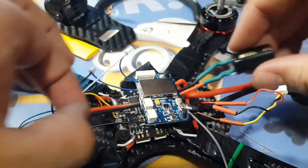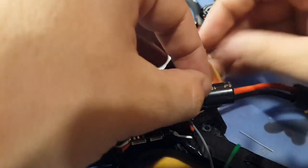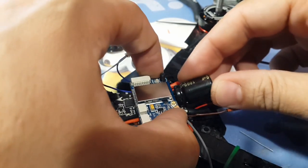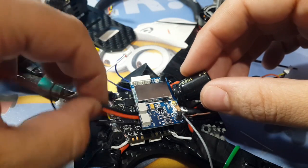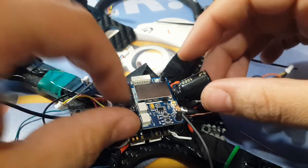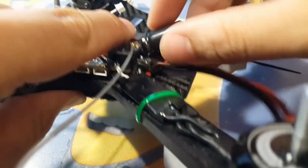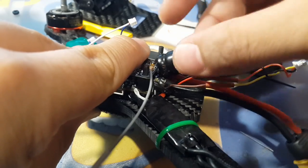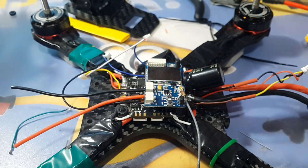Just stick them in like this and pull it all the way back. This way the flex is not bending any of the pins, and I'm just going to solder these — one here, one here. It's going to be nice. It's not going to be in the way of anything and there should be no reason for it to move. Vibration should be fine. This is how I'm about to do it, and I'll be right back for our final test of the flicker problem — on the bench at least — to see if it solves the problem.